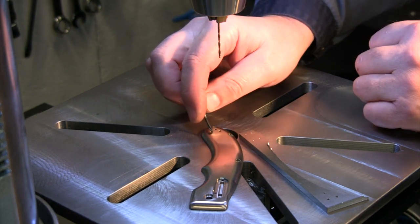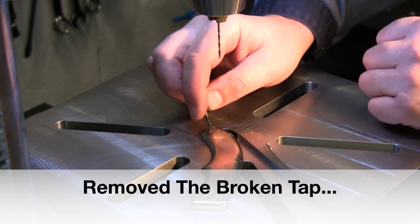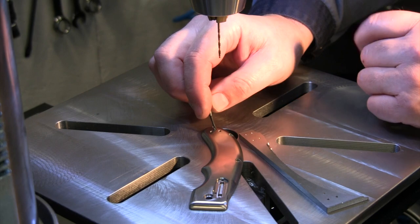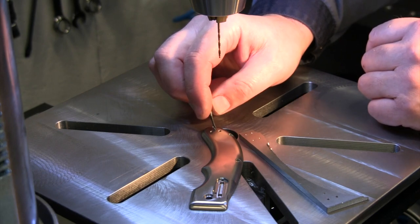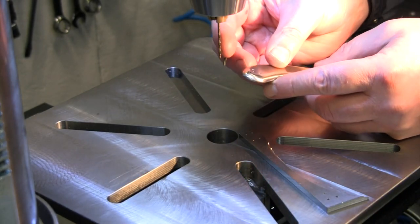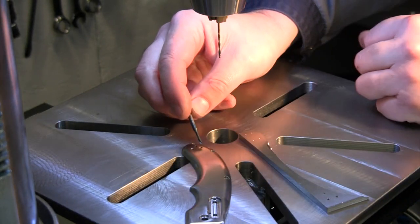I went ahead and the hole where I drilled and kind of marred up the hole a little bit, it had some threads in it, but I finished tapping that by hand and it cut really nice. We had another hole on here that was tapped about halfway through. I finished tapping that by hand. So I've got one hole left on here that isn't tapped at all. This one right over here.